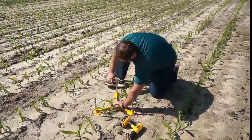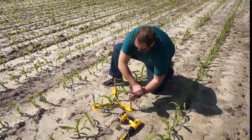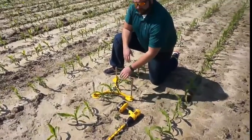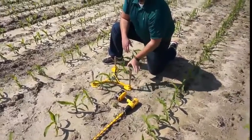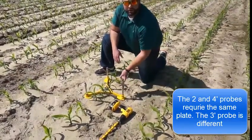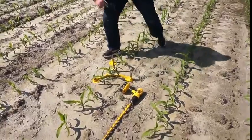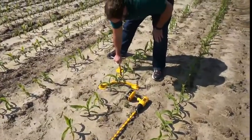The adapter plate — is it different for a three-foot? Today we're going to put a two-foot probe in here. This swivel plate adapter is very important. You have to make sure you have the correct swivel plate for the correct moisture probe you're putting in. The two-foot and the four-foot use the same swivel plate. The three-foot adapter is different, so make sure that's noted on your order if you're ordering a brand-new kit or if you have a customer that wants a different length. The tripod looks pretty stable — it's pretty tight, pretty snug.